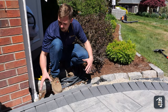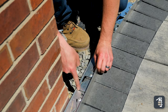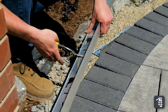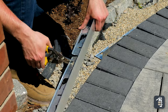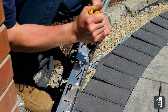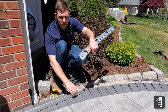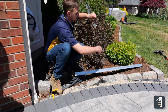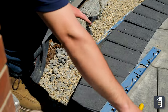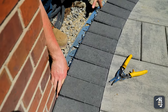Now we come to the last piece — make sure we get it cut right to this edge here. You could technically cut here because this is going to cover this paver, but for this purpose let's cut here and make a little tick mark to give ourselves some room, and cut right into this edge. You can bend this out of the way when you're doing this. Cut back and then cut down from the top. As we get it close, we can take it, bend it back and forth a couple of times to make that break. Set this one off to the side. We're going to bend back our last tab — sometimes I'll just use the snips if I can't find the special tool. Bend that tab up, set the next piece on, push it down in, bring it over. Perfect every time.